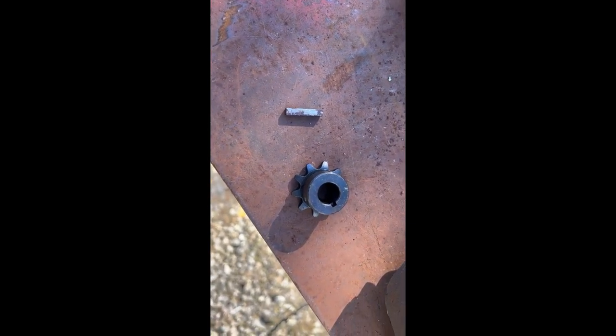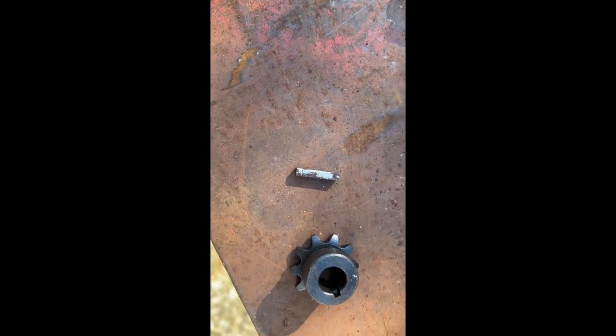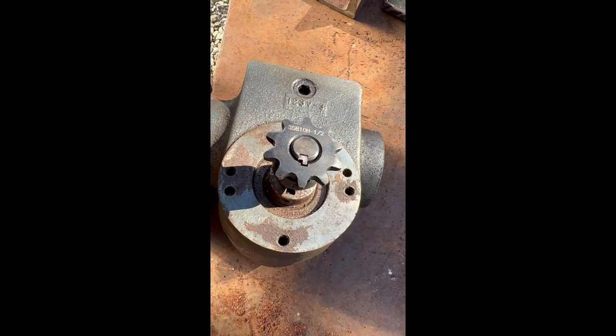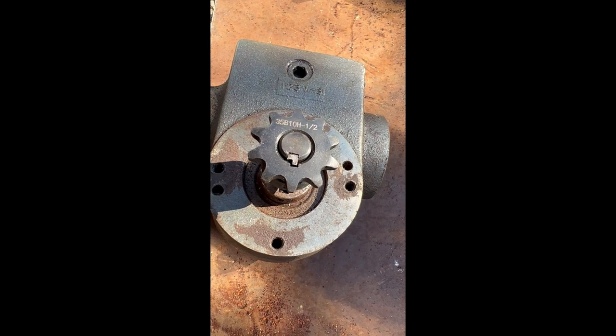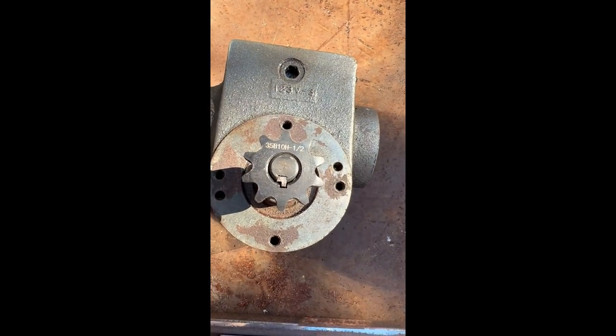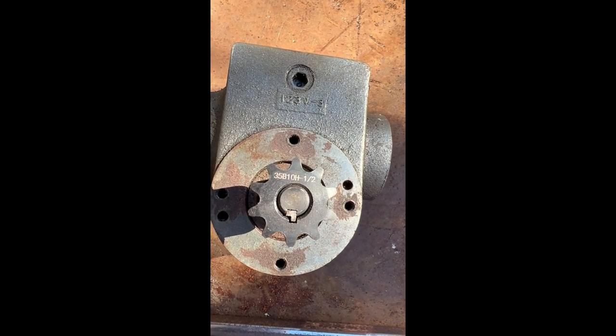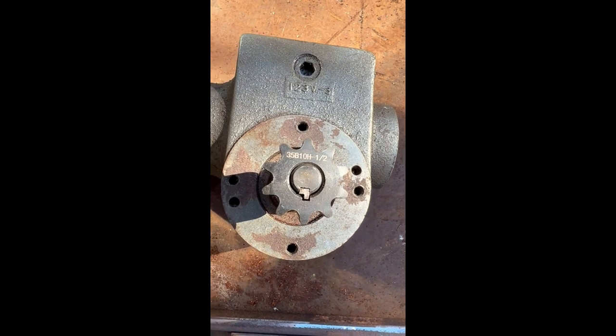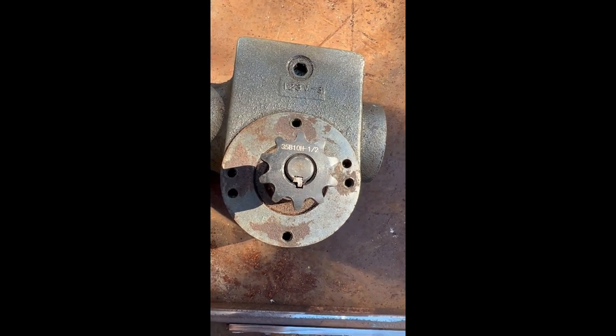This is going to take a special shear pin. It's skinny on the sprocket side, it's fatter on the shaft side, so we'll have to operate on this little booger. So a little tricky to hold that little bitty thing in the vise while I ground that corner out, but I got it. The sprocket is a little loose on the shaft, so when I tighten it up, it's not quite centered. I mean, we're talking thousandths, but it's not right. I don't know if that's going to come back to haunt me or not.